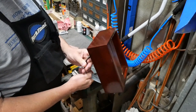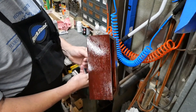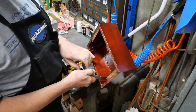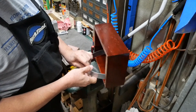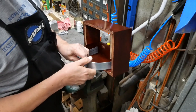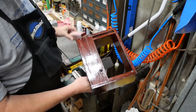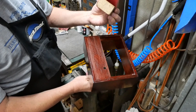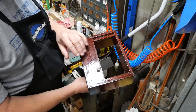I've been through a few cycles now — I've rubbed down and revarnished this thing and made some progress I guess. I've still got a couple of areas I'm not happy with, but the breakthrough was making a temporary handle which I fitted to the battery bracket mounting points. I've been rubbing it down between coats using this 240-grit paper — whatever this pink colour is, it does seem to work fairly well for flattening varnish down without clogging up.